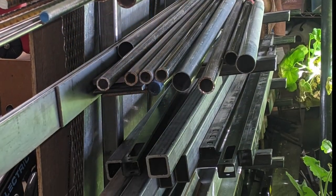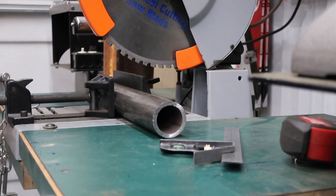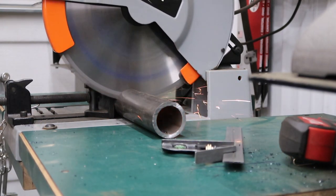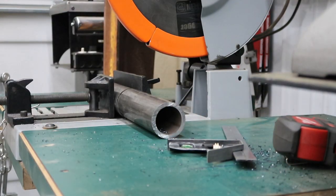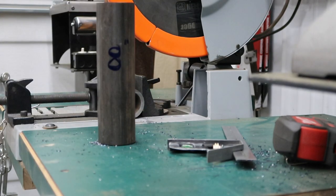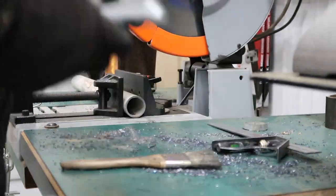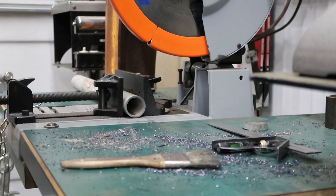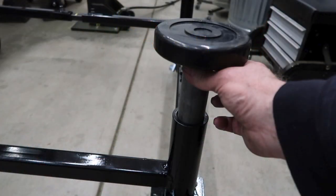We'll be using the metal that we have on hand to make these accessories. We wanted our truck cab dolly to be expandable so we could fit various sizes of cabs and bodies on it. We started by cutting legs from two and a quarter inch pipe with one quarter inch wall — four legs each eight inches long. We also cut four eight and a quarter inch long sections of one and three quarter inch pipe. These pipes will fit inside the legs and hold the four lift pads the cab will sit on.